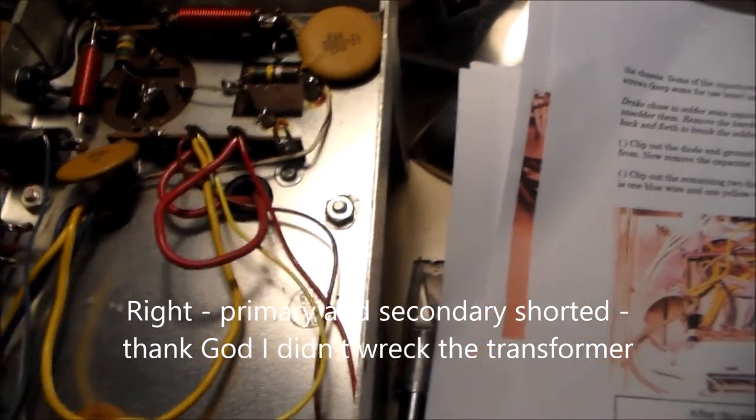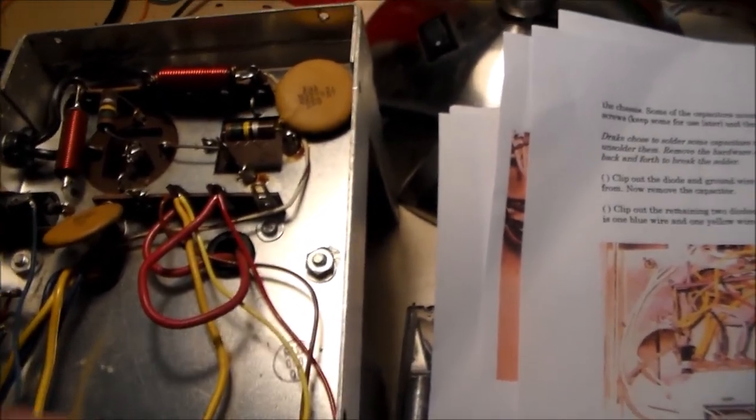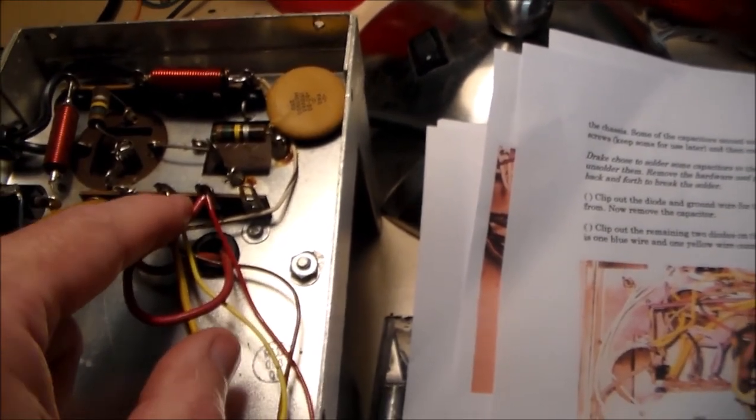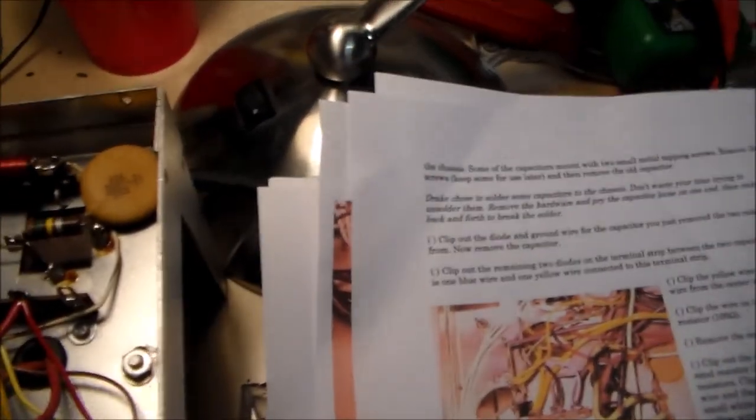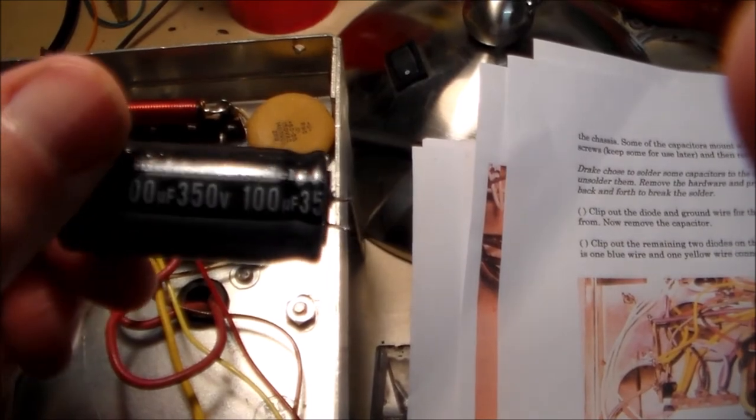and then we will see what happens. I'm going to continue to review the other wiring that I've done. But so far, that's my primary suspect, that this represents some sort of short, or I'm putting too much voltage into that particular section of the circuit, and it overwhelmed those 350 volt capacitors, or at least one of the three 350 volt capacitors.